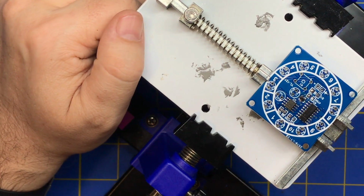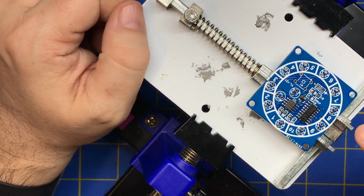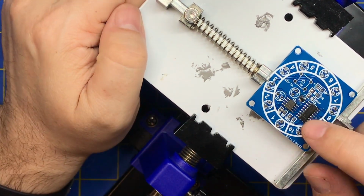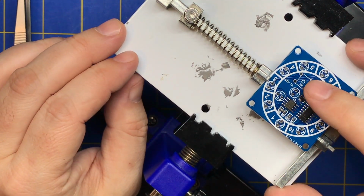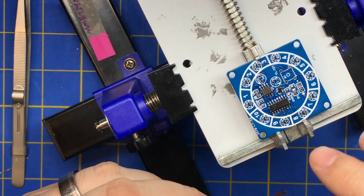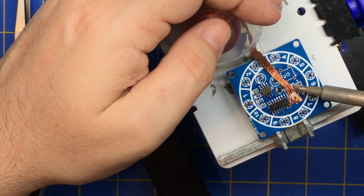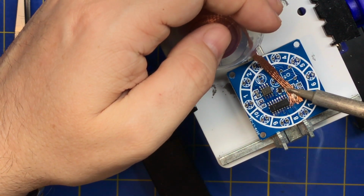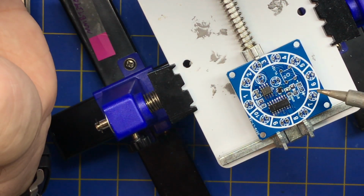and then go in there and start pulling solder off. If you have a solder wick, hit it with the solder wick. Make sure the solder wick is hot. Don't drag it, or else it'll stick and pull a pin off and pull your copper off. I guess I could demonstrate this over here. I put too much solder on there, so I'm going to put an unused piece of copper there, and then I'll push down on it and let it get real warm before I start moving it, and then pull it off. See, it pulled all that solder off.